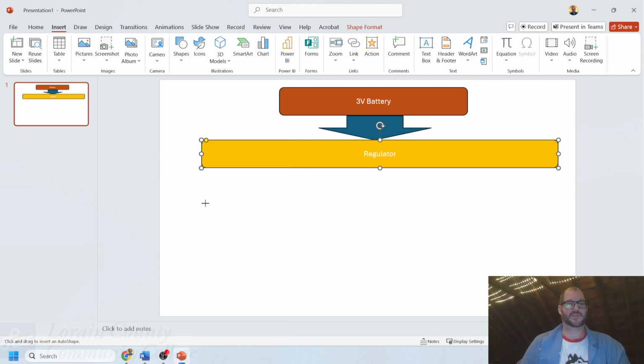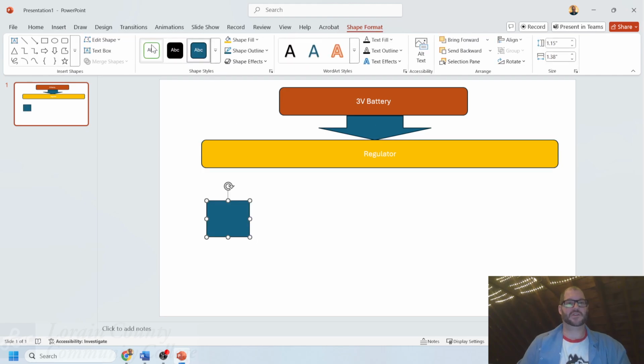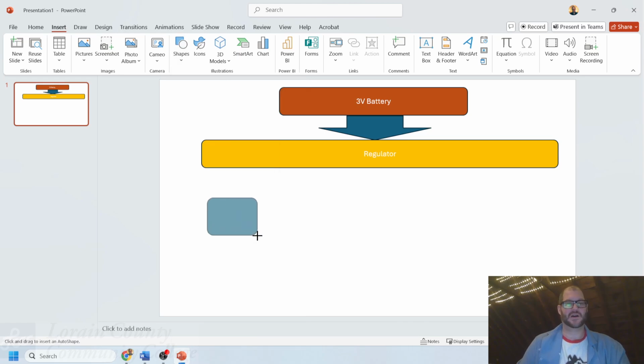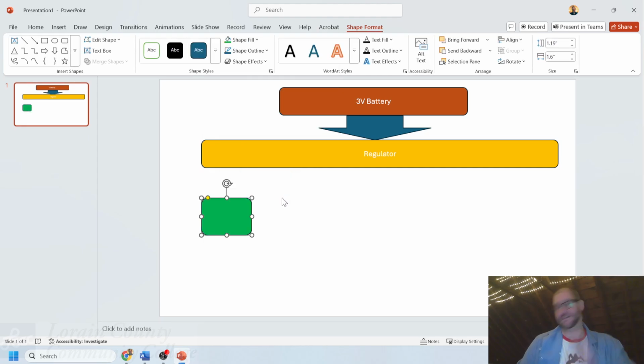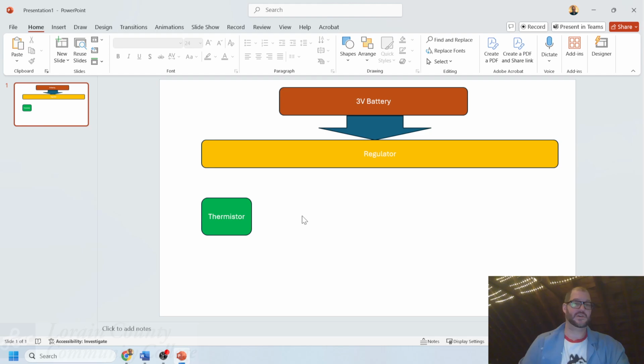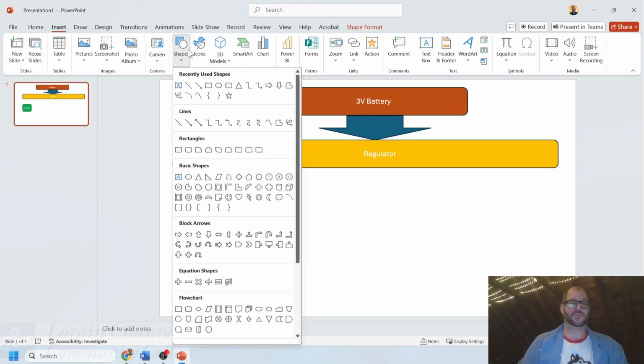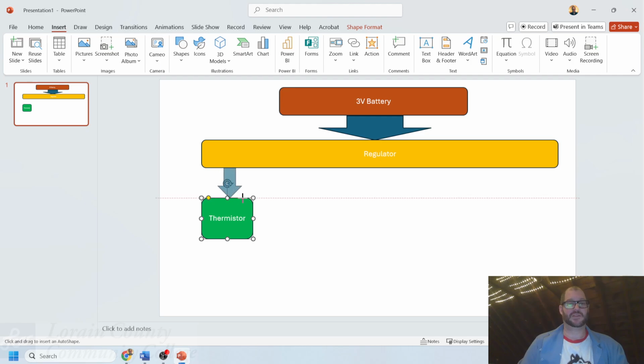Now, the next thing I'm going to put down right here is an interesting little device. I'm going to change the shape of this ever so slightly. This isn't part of my specifications, but I just thought about it right now as something that would be fun to add in, as they are not so expensive a device to get, but we shall see. I'm going to put on here a thermistor. A thermistor is an electronic sensor that changes its electronic value with temperature. And I think there's a way that we can add some thermistors to our circuit board that might make this a little more fun and functional, making the lights, for instance, blink faster or slower potentially with applied heat or something associated with that. So we'll see if we can get away with something like that.